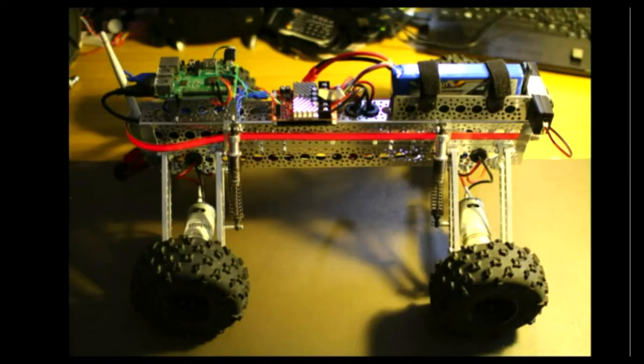This was the first thing that started introducing me to high-amp robotics, because the stepper motors each want two amps. So then you need to get these horrific lithium polymer batteries. I haven't had any issues with them, but it wasn't something I was looking forward to.